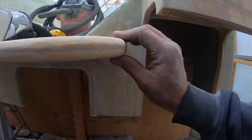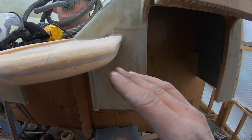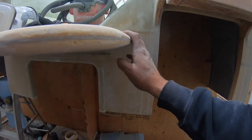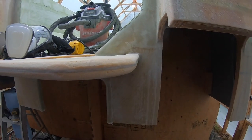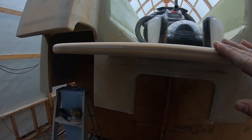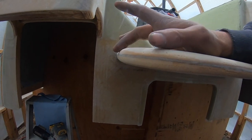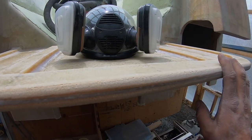What I've done is I've radiused these corners so it's a smoother, larger diameter radius. I want to say it's 5/8ths — the bit that I have. I may have just had the wrong bit the last time and thought it was the right one. We've had this issue once before and it was just easier to tear everything off and start from scratch. So we have a nice bullnose on this now. I hit it with a sanding block by hand just to touch up any edges. You do have to be careful once you have exposed foam because it sands down extremely quickly — that's why I used the hand sanding block. Everything's cleaned up, ready to go. Hopefully that solves our problem.